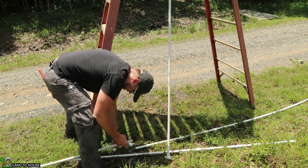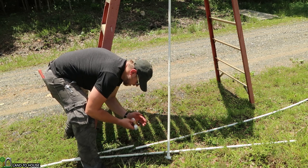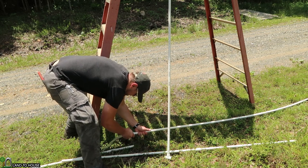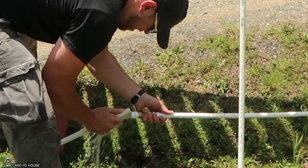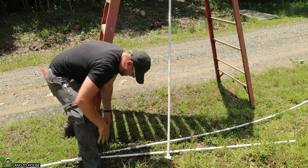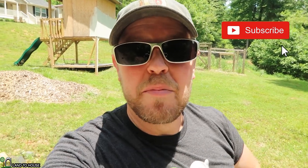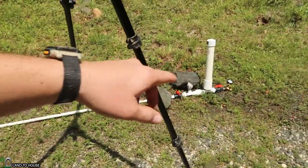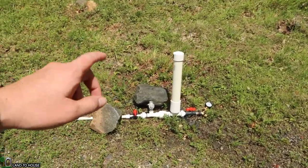I'm going to replace that section with this non-return valve that is swinging down, so it will allow water in to the pump but not back up. If you're excited to find out if a non-return valve can act as a stand pipe, hit that subscribe button and be sure to ring the notification bell. So the thought is replacing the stand pipe with a non-return valve will allow the pressure wave to go from here, smack that valve and come back down and be the same speed that we had on the stand pipe version. Let's go ahead and get this test done.